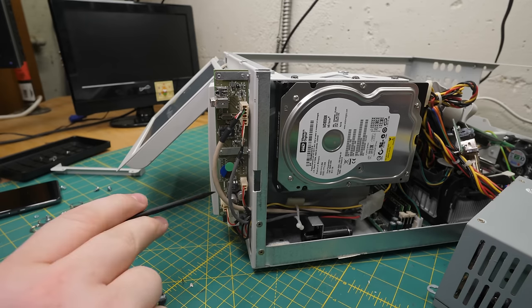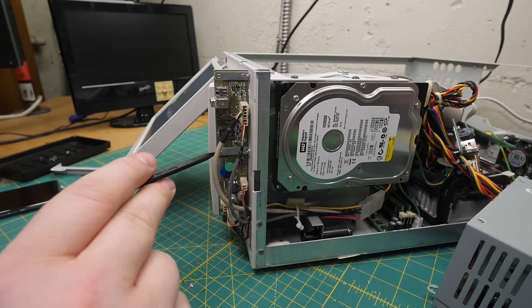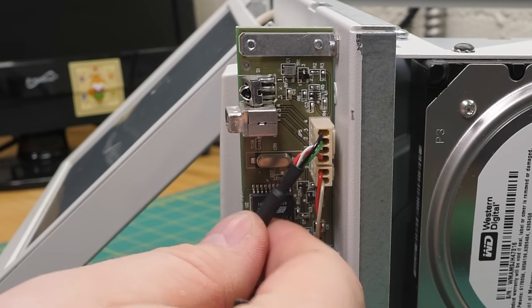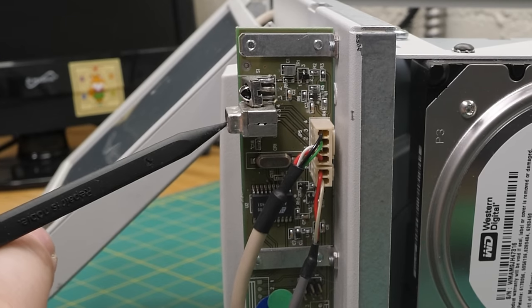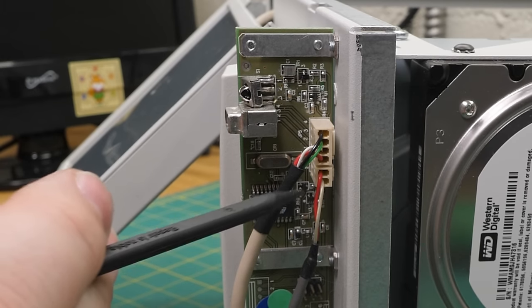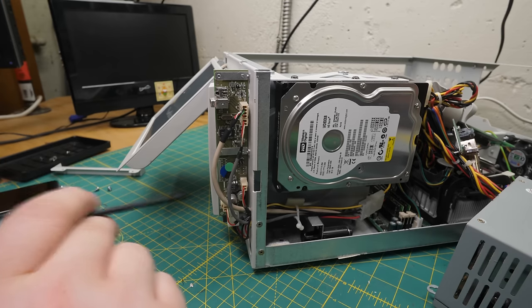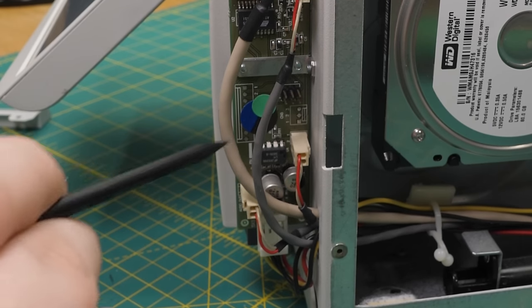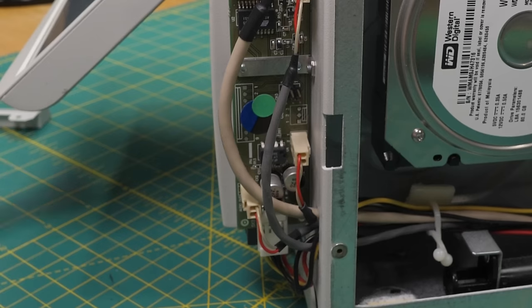I do notice these lower two are both called 'audio out', and I don't really know what any audio would be doing up here. I don't know what this little board is for, for the most part. So this is obviously the USB port - it's got the four pins in the standard USB colors: green, black, red, and white - standard for USB 1 and 2. This is just looping over to the motherboard. And then this guy here would appear to be what's going to the capture card. But what's with the rest of this? There's a chip that for all the world looks like it's probably an op-amp, and this thing is receiving power. So this seems to be an audio amplifier board.